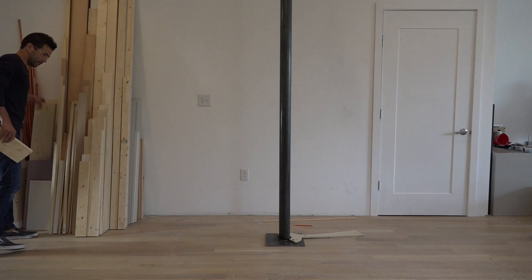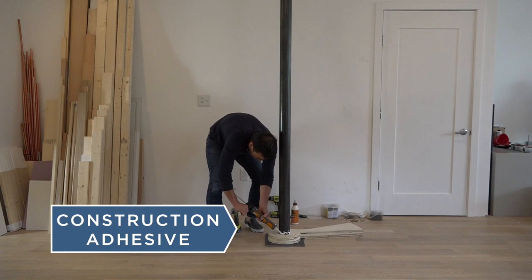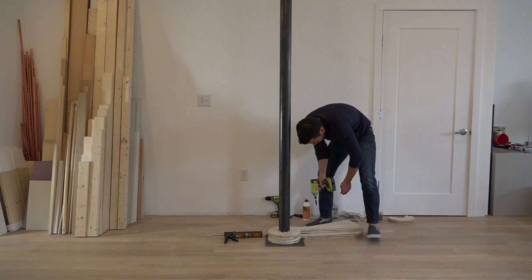The first step is going to be installed right over the half-inch thick plate, so I had to plane down an extra piece of plywood to act as a spacer. I used construction adhesive between the plywood and the steel pole, and wood glue between the layers of plywood. I made sure to press down on the steps firmly before driving 3-inch finished screws through the plywood.